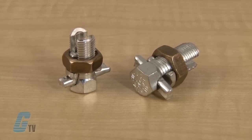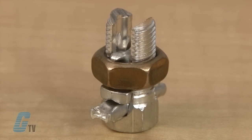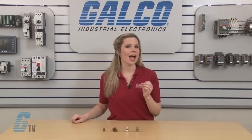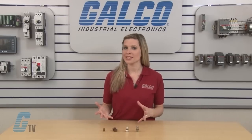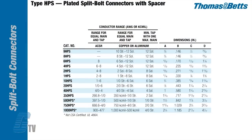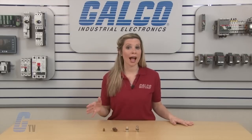The HPS series is designed for use on copper, aluminum, and ACSR conductors. The bolt and pressure bar are made of copper alloy and are completely tin plated for corrosion resistance. There is a contoured spacer of electrolytic copper up through 4 aught sizes and bronze alloy for 350 MCM and above. All unit sizes are tin plated. For copper or aluminum, the HPS series has a conductor range for equal main and tap from 12 gauge solid wire in the smaller units to 1000 MCM in the larger units. Most connectors are UL listed and CSA certified for copper conductor only.